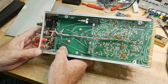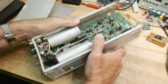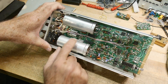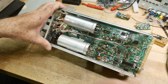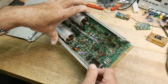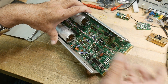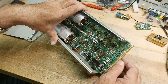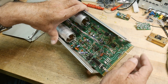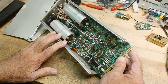I paid a little money for it. It's got some giant capacitors in it — don't know if those are good or bad. One of the other negatives for these is the sockets that Tektronix used. They have really terrible edge connection sockets. Most people just say immediately re-socket the whole thing. That's a lot of work. Recapping is bad enough, but re-socketing everything — oh my goodness.